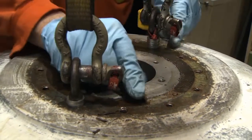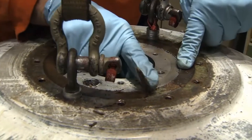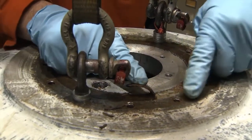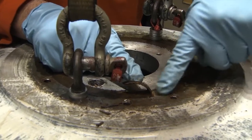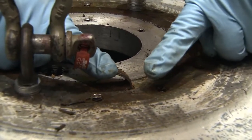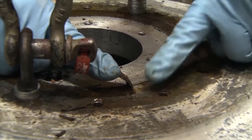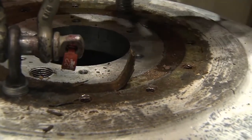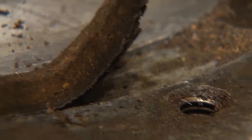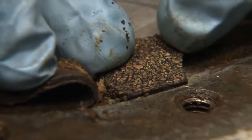I'm going to determine the thickness of the gasket that I require. To determine the thickness, measure the depth of the channel that the gasket is seated in and add an additional 33%. The additional percentage factor is based on the average amount of compression that will occur over time, so that when the bushing is reassembled 33% of the thickness will be available for compression to create a proper seal. A one-eighth inch thick gasket with the 33% overage in thickness available to be compressed will be very suitable for this application.